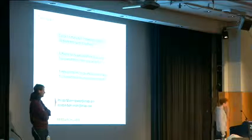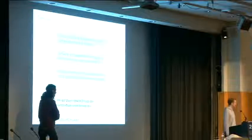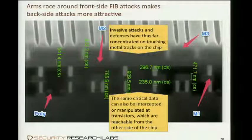Next question from the right-hand side room microphone. I have 2 questions, one for Carsten and one for Dexter. Carsten first. If you go back 1 slide, my question is about the last slide. You are talking about backside fibbing here and chip thinning, and this being a new attack, but I heard about this when working at a chip manufacturer in 2005, I think it was, 2006 maybe. It's been around for a while. Why is this technology just now being... Puzzling to me as well. So there are people who can pull this off. None of them are involved in security, though. Yeah, they were not security people. They will measure properties of transistors, analog properties, so much harder to execute analyses than just intercepting bus bits. But this hasn't been proven to work on a smart card with some security functionality, and it's about time that somebody does it.